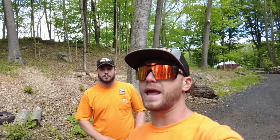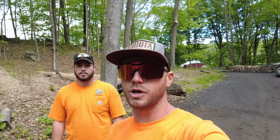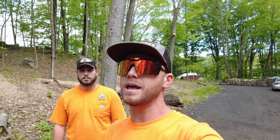Yeah, this Eastonmade 2228 with the attached conveyor, and we're running the 7-way pizza box wedge because that's the size wood that our customers like. We convey into 4 totes at a time off grizzly bars, so even though it really only takes one person to split, this machine is so fast that you really need a second person helping to run the rounds over and push them over to the log lift.